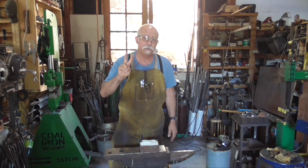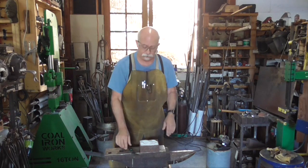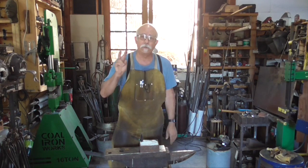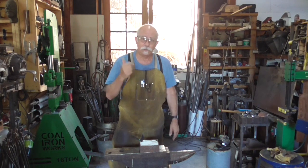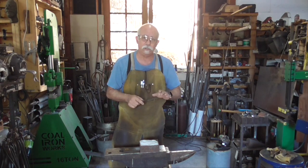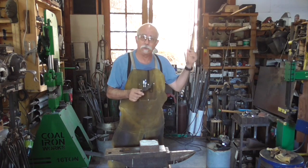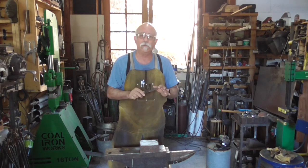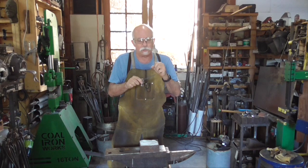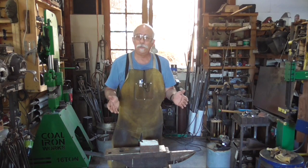Leave it for two hours. Take it out, take the knife out of there, let it cool down to room temperature. Put the knife back in — it will be hot so be careful — and put it in for another two hours. So: two hours, let it cool to room temperature, then two more hours. Also, don't put this in the oven until your knife has cooled down to room temperature and you've cleaned it off. Do not wait too long to do this — you want to do it within half an hour to an hour after you've hardened it. The reason is the knife is in a very stressed state: very brittle and hard, with the molecules locked and really stressed. Tempering also reduces that stress. And with that, we're done with this video.